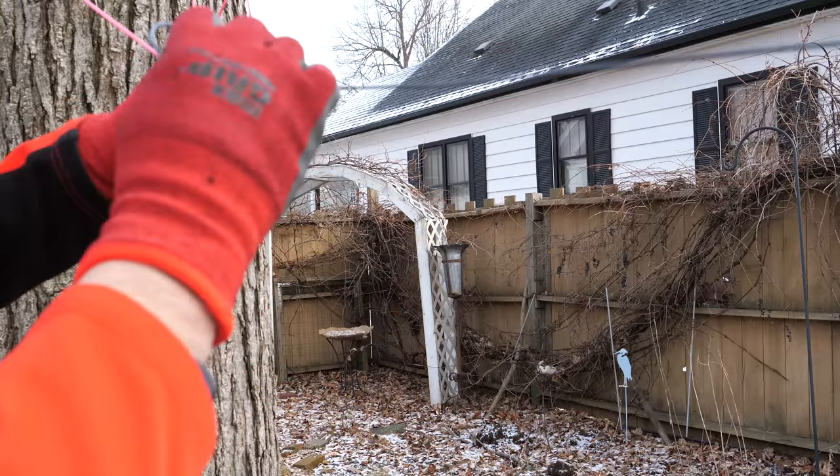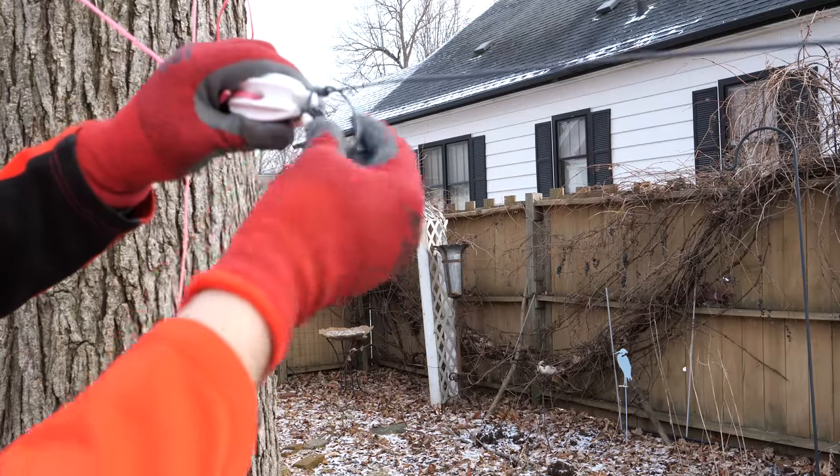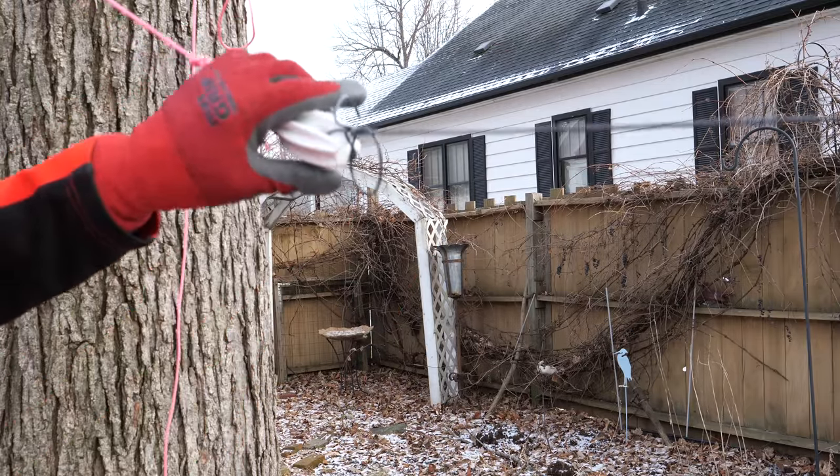I had some extra wire on the end because I just added some for adding the insulators, and you always want to put a little bit of extra wire on your dipole antennas because you can always trim down, but it's tougher to add more. So I reduced it about 6 inches on both sides, put it back onto the meter, and what I get is an SWR of about 1.3 to 1 in the 10 meter band.